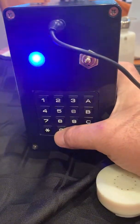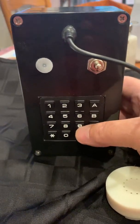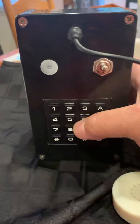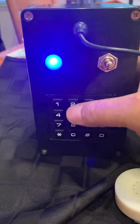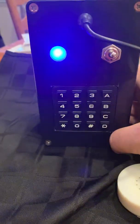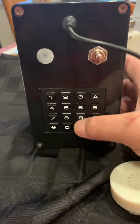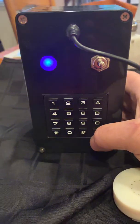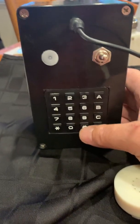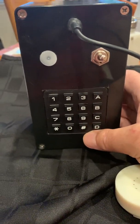The final mode, on zero, is a pre-IMTS mobile telephone system used by General Electric called the C-code system. It's a dial-pulse system that uses a different set of multi-frequency tones, very similar to IMTS, though the connect and disconnect tones are a little different. These were in use up until probably the early 1990s when all pre-cellular mobile phone systems were phased out — included here for historical interest.